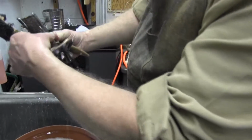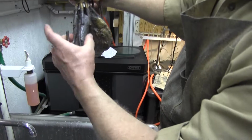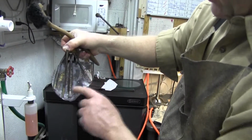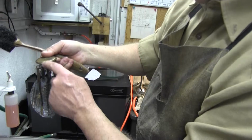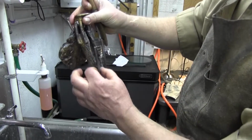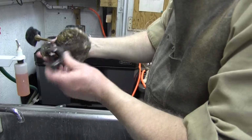And there's the hand-carved trunk. And these are just vents. So this was poured this way. The bronze went in, filled the stump area, filled the bog area through these three sprues, and then the vents vented up. This one was closed off by the button pouring over, but this one completely vented up, and these two vented up until it was filled and stopped running. It is a complete casting, and it's just beautiful.